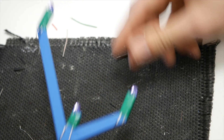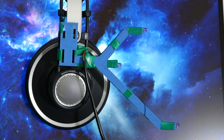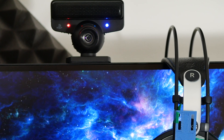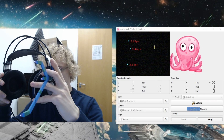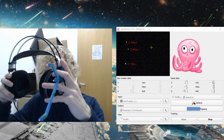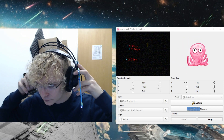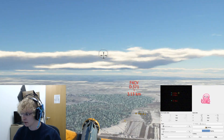So how does this actually work? It uses three infrared LEDs attached to one side of your headset and an IR camera. That's pretty much it. The camera ignores visible light and instead only picks up the infrared light given off by the LEDs. By doing some quick maths, software can work out which way you're pointing and where you are in 3D space, just based off of the LEDs' positioning. Then this information is translated into in-game camera movements.